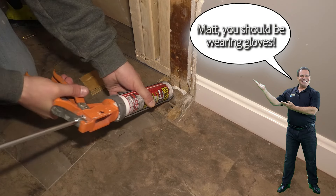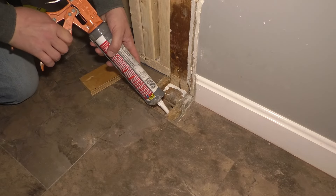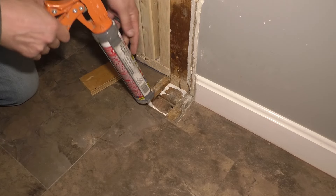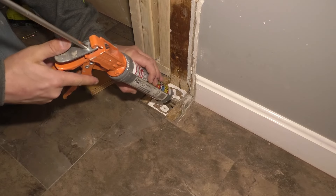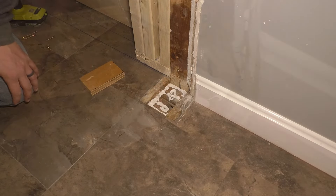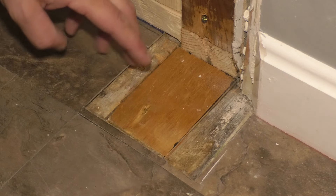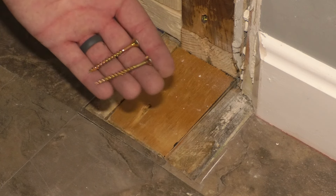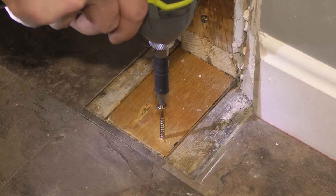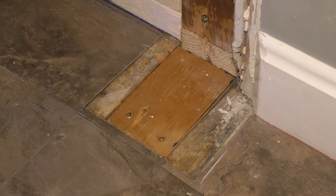I like to load up all the corners and put a bunch in there. I have a basement under there — if a little glue falls through the cracks, that's all right, but I will try to avoid that space in the middle. Now I can take my piece and push it in there. At this point you could throw some nails in here, but what I like to do is use screws. These are two inch construction screws and it should pull it right down into place. I like using screws because I feel like they grab a lot better. And ideally if your floor is opened up enough and you can find joists, getting some long screws right into the joist would be the way to go.